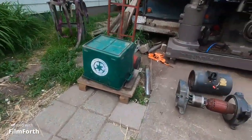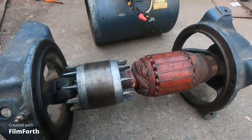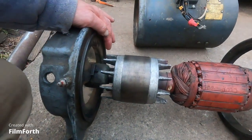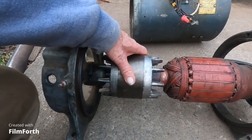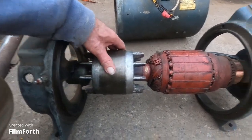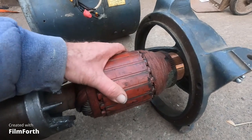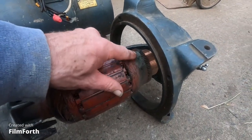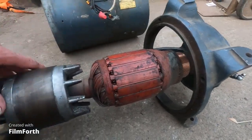Both ends are burnt out — let's have a look. Here it is. This is a dual armature, and this is why they call it a motor generator. This is the AC motor part here, and of course this is the direct current armature. What happened is it got overheated and it burned a hole in it, and I covered that with epoxy glue.